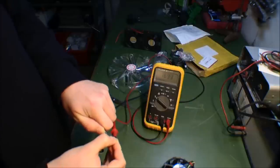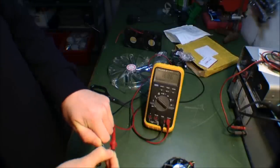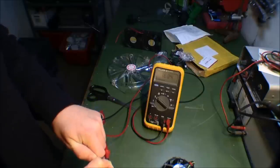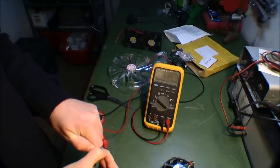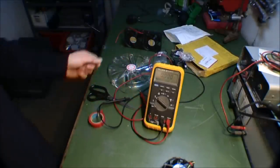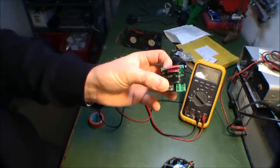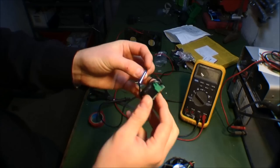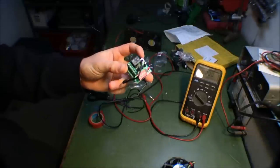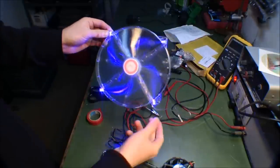I'll just assure that I did this correct. This is a 12-volt power supply, and it's in fact putting out 16 volts — but this is open circuit, so it's probably okay when it's taking a load. But this is just to ensure that I don't ruin my good Chinese controller. I've now hooked this up and connected this fan blower — and it's blue. Who would have known. I really don't need that. And it's kind of making a noise; maybe it got a little bent in the package. So I'm hoping that will go away, or that I can just put it somewhere and it won't make too much noise.